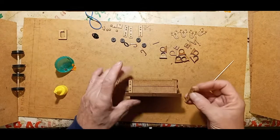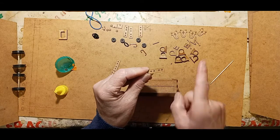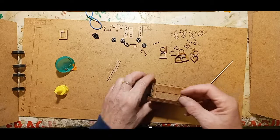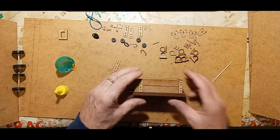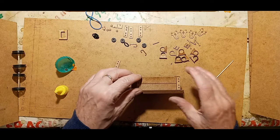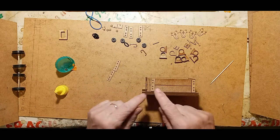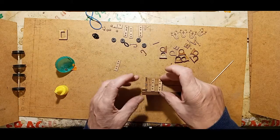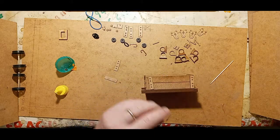The bolt holes are also offset in one direction. When you put them on, you need to put it on so that the small gap is at the top. As I've done on that end — you can see that the two bolt holes go central to the plank. If you put it the other way up on the other side it wouldn't be central. So to clarify: that's going to work there because it's central. If you put the wrong one on, the holes would be in the wrong place. So that's an important bit to bear in mind.